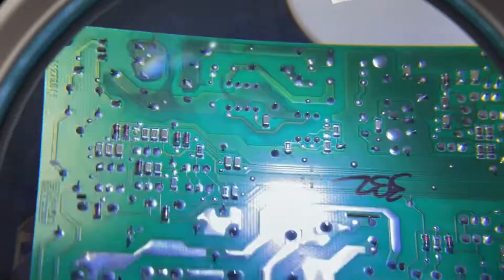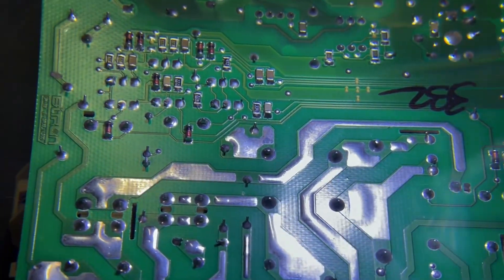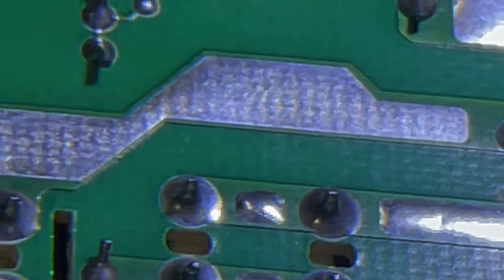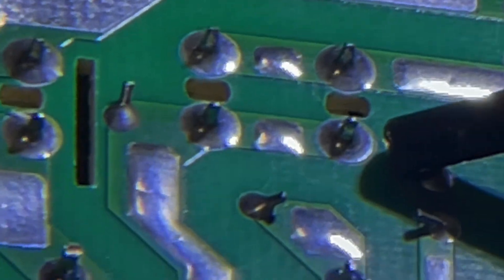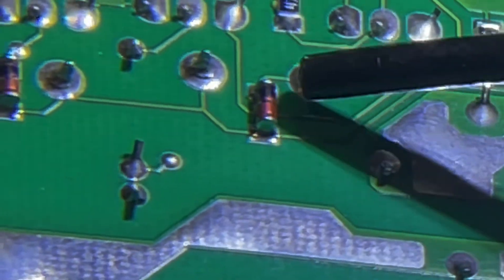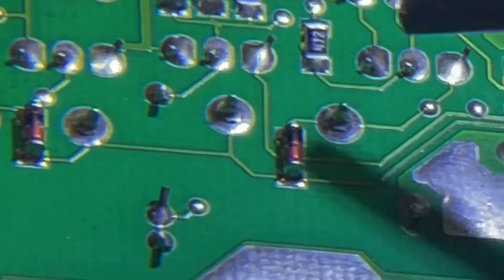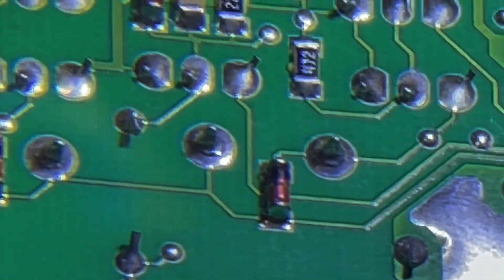They drive all these different things, and this is very common in your car too. So what I'm going to do is replace this and show you — they look okay to the fairly naked eye, but when you start zooming in, you'll see a little circle around it, and you'll notice that circle is defined. It's actually a connection that's probably making or breaking — not very good. It's called a cold solder joint. There are three of those right on a couple of relays. If I solder those up, I believe the unit will work just fine.